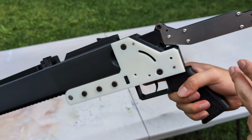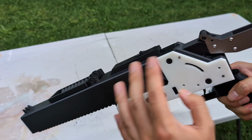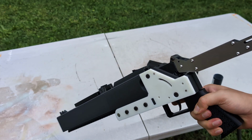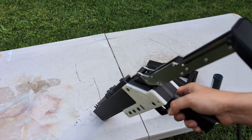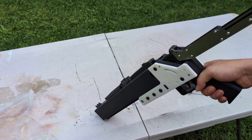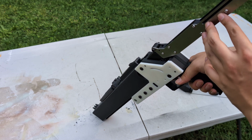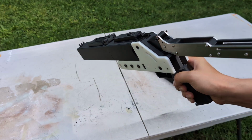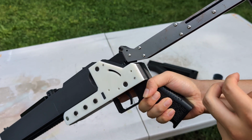In my design, I eliminated the self-cocking hammer, so it will be very reliable in both opening up the barrel after firing and igniting the primer. Also, this stock is my experimentation on stock placement, and everyone who has shot a lot of guns will know usually the best practice is to place the stock in the same axis as the barrel, so the recoil of the round will be pushed straight into the shoulder of the shooter, and this is the result.